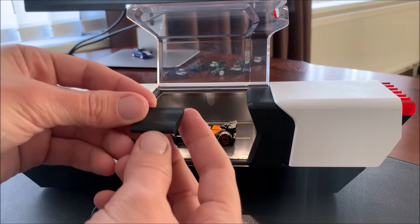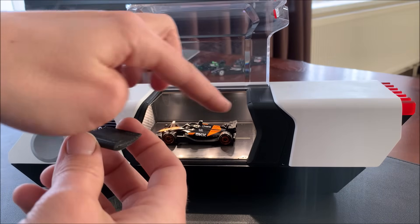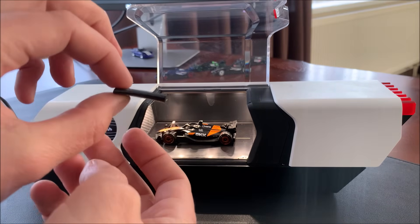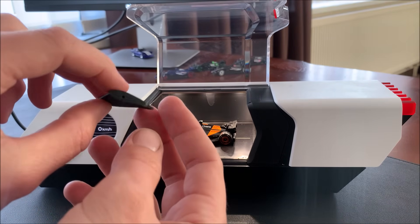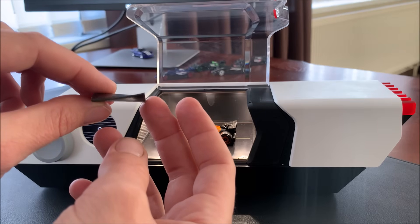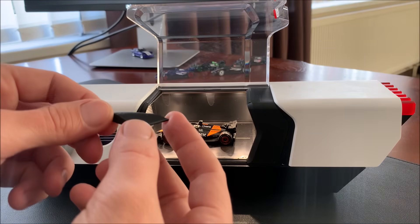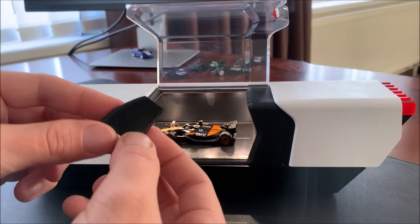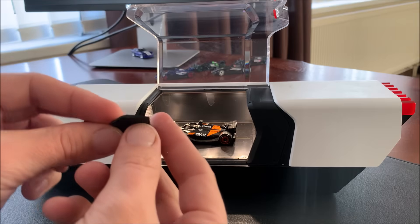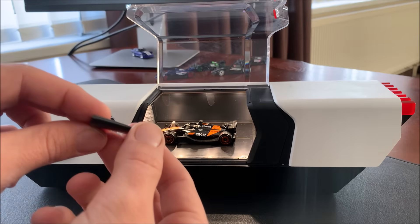I created exactly the same profile again but a bit shorter so we can analyze the tip vortex, because our streamlines will be in the middle where the white line is in the wind tunnel. Then I've created this very curved profile — it's creating downforce on one side and lift on the other. And we have one wing element with the same span that tries to reduce the tip vortex by reducing the chord length and using a thinner, symmetric profile at the tip.